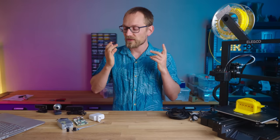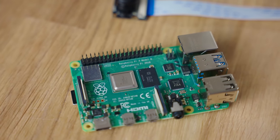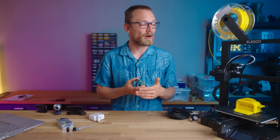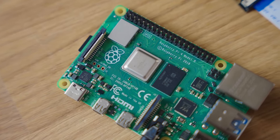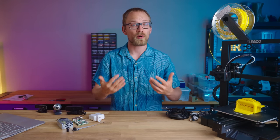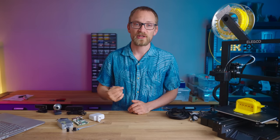Let's start with the hardware needed. First of all, you're going to need a Raspberry Pi. I'm using a Pi 4 with 2GB of RAM, and while OctoPrint can run on almost any Raspberry Pi ever made, you should stick to a Pi 3 and up for the best experience. Alternatively, you can also run OctoPrint on a Windows, Linux, or macOS machine that you already have, as long as it's not going to reboot in the middle of your print — I'm looking at you, Windows 10.